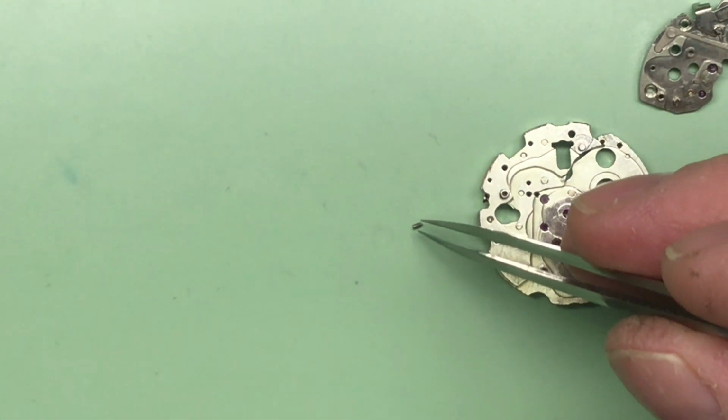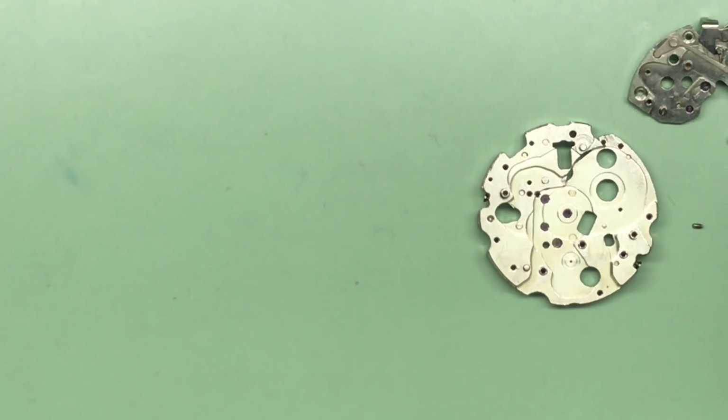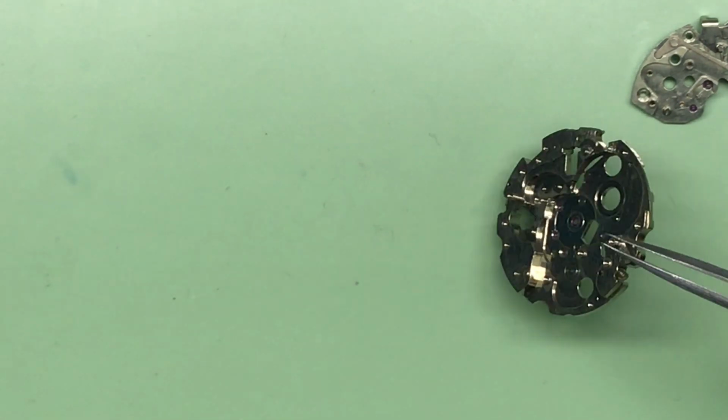Well, I was persistent, and luckily, these screws don't bottom out. They don't actually tighten against a surface. They tighten against this upper surface where the screw head is, so that would go there. And what's nice is that the actual threads go down further than the screw does. So if it's a clean break and there's no residual issue, if it's just that the head broke off, then if you're careful and persistent, you can actually remove the stud. So I was able to do that, which saved you essentially a whole main plate.